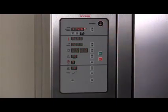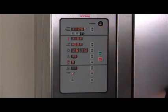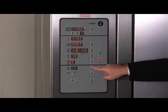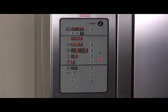When the oven is off, press and hold the up arrow next to the steps display in the program panel. While pressing and holding the up arrow, press the power button for 3 seconds. When the beep sounds, you can start entering recipes. Next, press the up or down arrows next to the recipe display until the desired recipe number is displayed. Changing an existing recipe will be discussed later in this video.